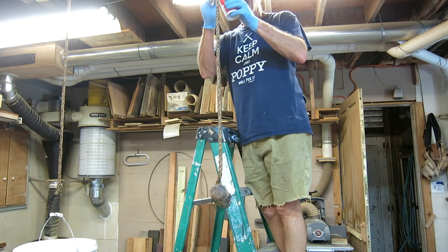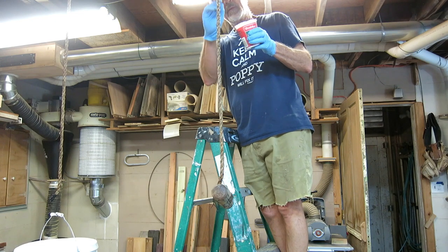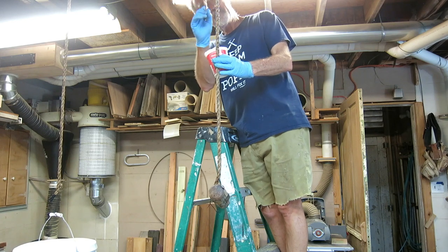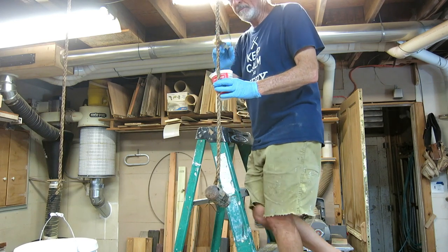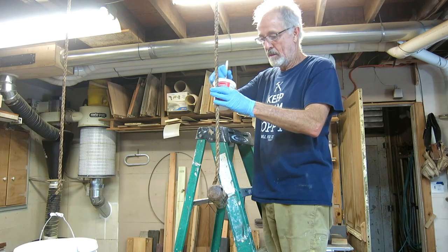And I got some epoxy glue and I mixed it with some solvent so it's kind of thin. And I painted the rope, and it did real good. It really wicked up into the hemp rope. I'm assuming I'm going to be able to put this rope with this epoxy impregnated rope in a burnout kiln and burn it out.